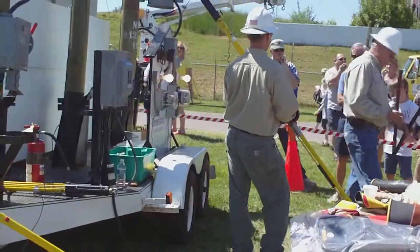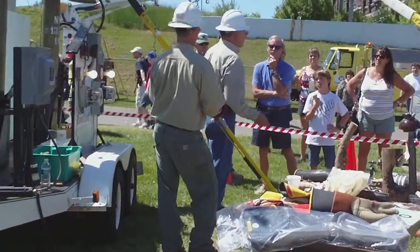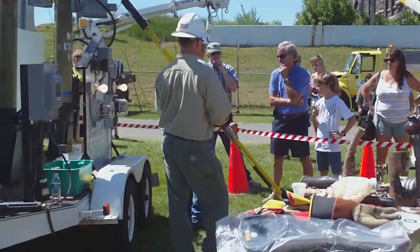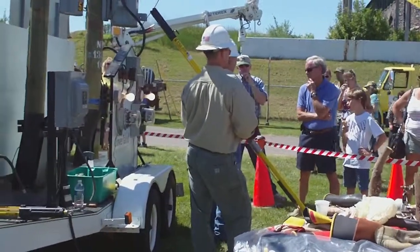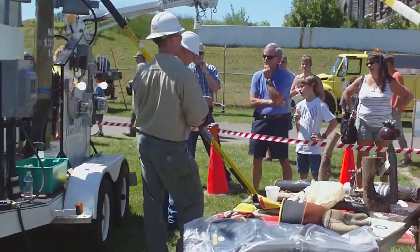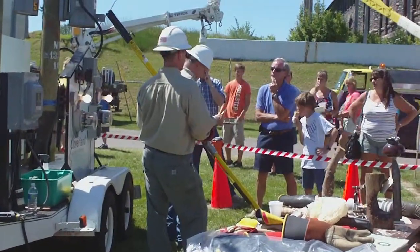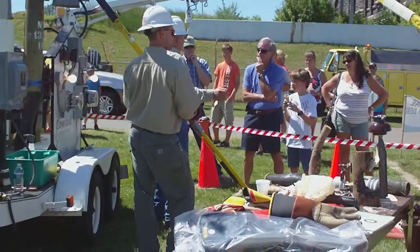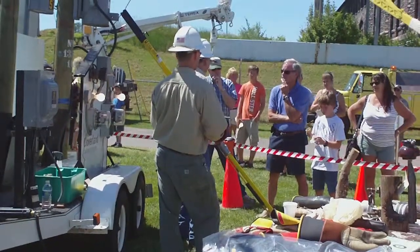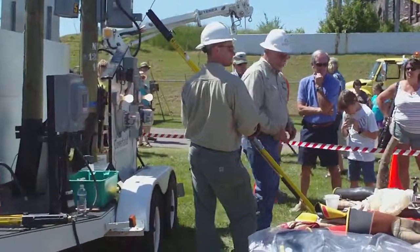Primary bonding. This is what happens in the middle of the night, maybe during the Super Bowl or something like that. That wire's aluminum. You put it in there, moisture gets inside of it. It might not go now, it might not go for three months, it might not go for six months. Voltage and current in the ground, water and stuff like that. The aluminum powders and just goes. You lose one leg or you lose the neutral at that point, and it's all over at that time.